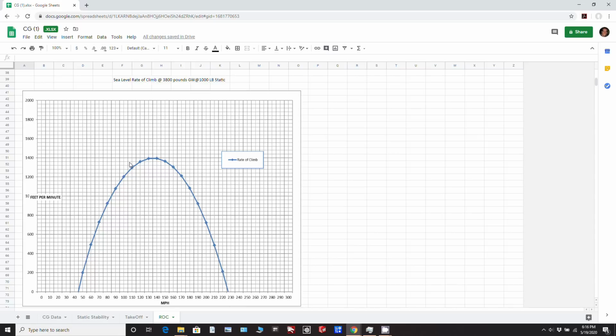But it'll be interesting to see when we actually do the first flight and we capture all this information. It'd be interesting to see how the numbers compare to what Mark's calculated here. But he was pretty accurate with his calculation of what sort of airspeed it would take to get the nose off with the canard, with the foreplane. And I know that when I took the aircraft up to about 80 knots and had the nose up, that almost got the mains off. You could see how light they got, and that was a while back now. But that was when I was actually powering back and letting the aircraft power back. So I think 85 knots there, and continuing to power out, we should be off the ground and be climbing maybe around about 1,200 feet a minute for this first one, with that angle of attack that we're going to have there. So we'll see how we go.